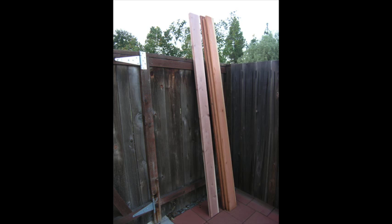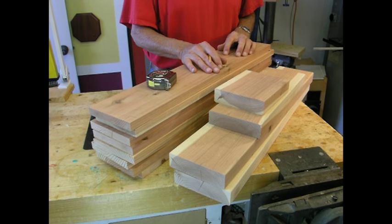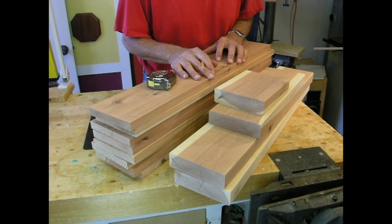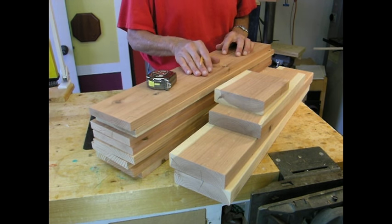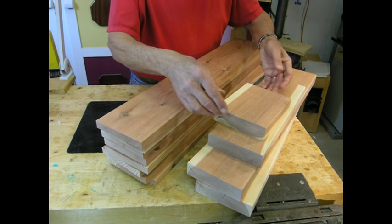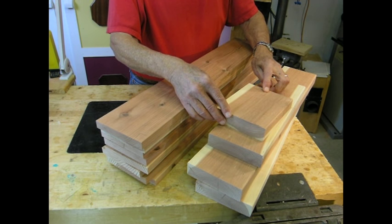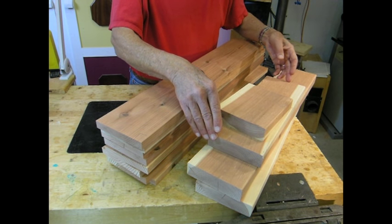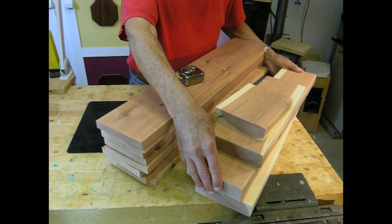Here is the redwood buy list as purchased: three eight-foot one-by-six planks for the barrel, and eight feet of two-by-six for the stands. Here are the basic parts for the planter and tall stands. The one-by-sixes have been cut to length for the barrel staves and milled to the final dimensions of three-quarter by five-and-a-quarter by 30 inches. I'll provide all these details in a subsequent chart. The two-by-six has been cut to approximate dimensions — one piece for the two upper crossbars, one for the two lower crossbars, and the remaining parts for the four legs of the stand.